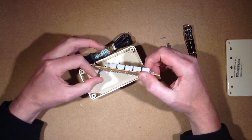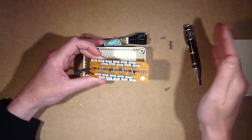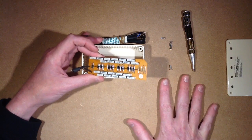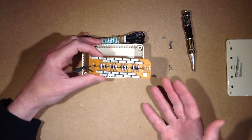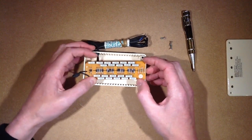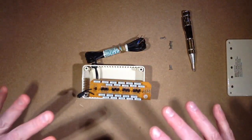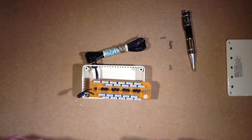The air is trying to find a surface of opposite polarity, and because it's referenced to the mains, it goes to any grounded surface in the vicinity — it could be the table. This might not look like a grounded surface, but in reality wood is still conductive enough in electrostatic terms to attract the electrostatically charged dust and ions out of the air. When you mount an ionizer well away from very conductive surfaces like metal shelving, it creates a cloud of negatively charged air looking to get back to a grounded positive surface, and that's what dissipates the dust out of the air.